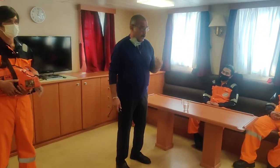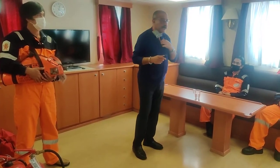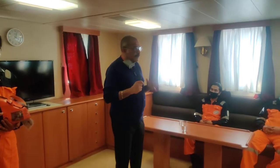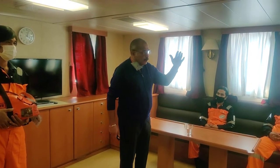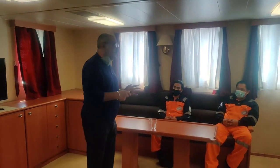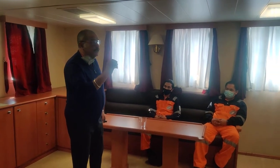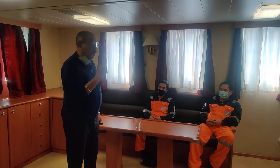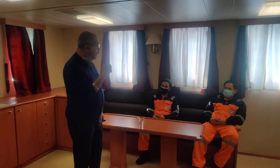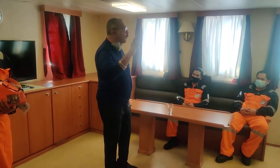Also, I'd like to apprise you that the enclosed space entry permit, which is to be filled up for deck or engine respectively, requires due diligence to be exercised. Finally, when I check, I sign the enclosed space entry permit, and I'm going to vet each and everything. The person who is going to work, let's say in the scavenge space or some cargo tank or ballast tank, when you are signing, it is your legitimate right to go through it. Because in case of any mishap, this is the only legal document which is produced in a court of law.